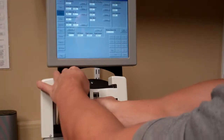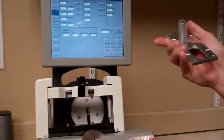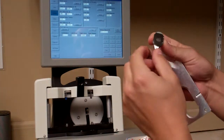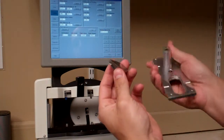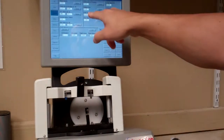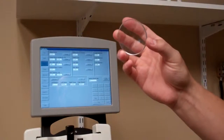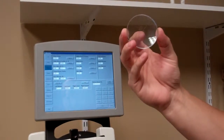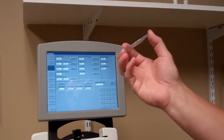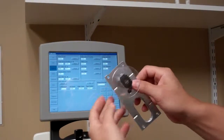Once done with Pattern Size, remove the 58mm metal disc and set aside the arm piece. Find the triangle-shaped lens holder piece from your kit and attach a blocking pad to it. Then find the plastic 58mm lens with a bevel from your kit — it may have a little X on it. Place it onto the blocking pad, trying to center it as best you can, with the dome of the lens facing forward.